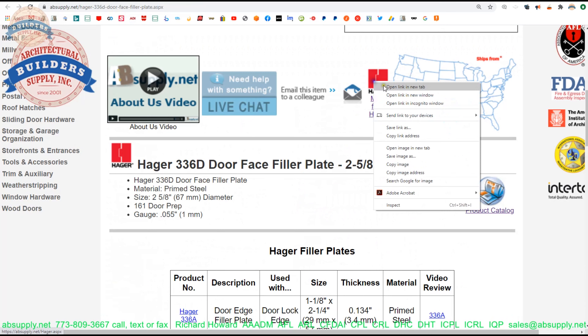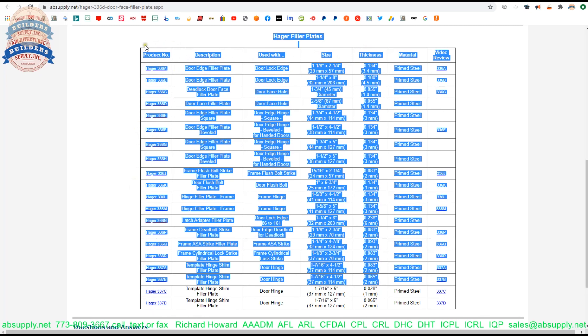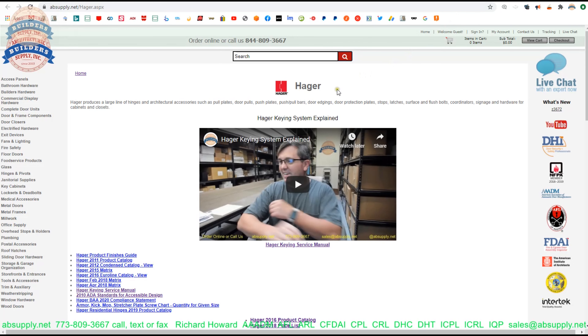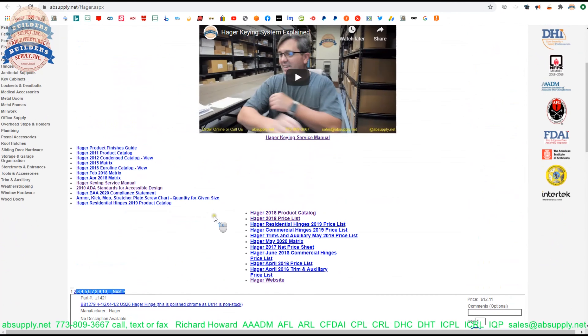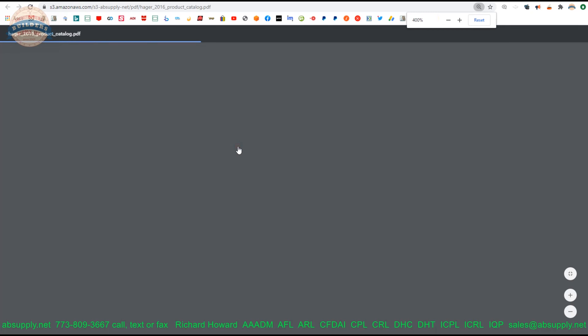There's an 86 edge filler — that's for a government 86 or a mortise lock prep. You'll have a deadbolt strike filler right here, an ASA filler, a T-strike filler, and four different shims in 5 inch and 4½ inch sizes and in 28 thousandths and 65 thousandths thicknesses. You have the 86 to 161 edge conversion — if you have a hollow metal door converting from a mortise lock prep to a cylindrical lock prep, you would want that adapter plate. Then you have a flush bolt strike filler and a flush bolt body filler as well.